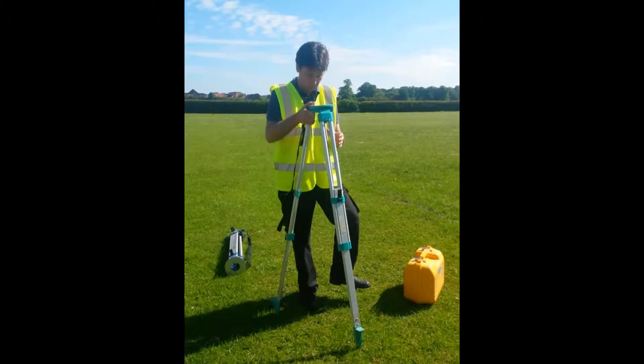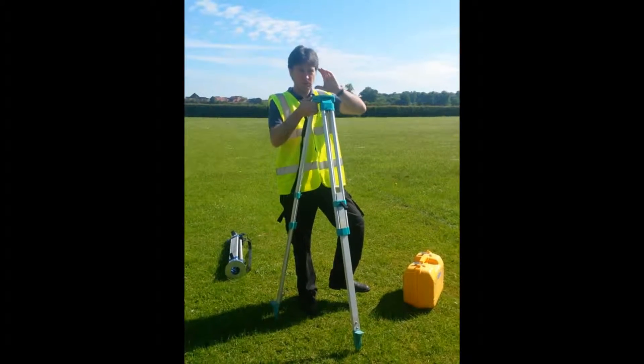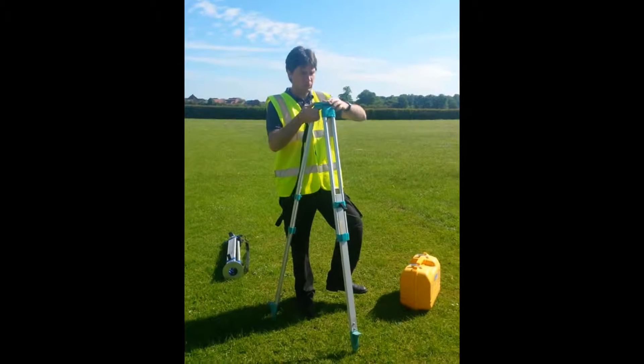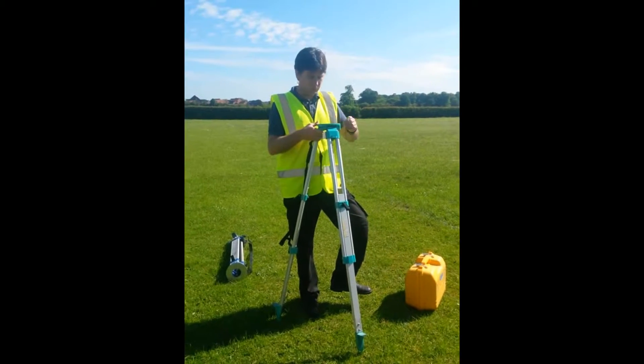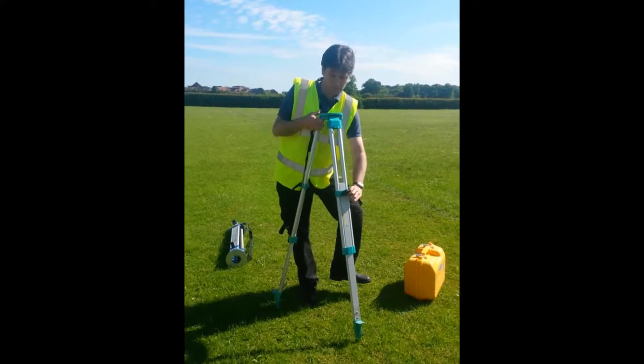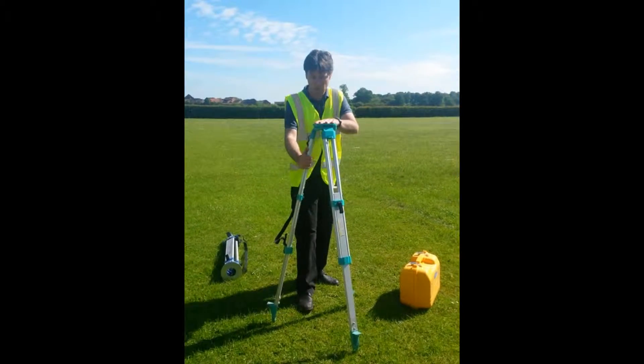I'll uncramp all three, pull them up, and try to get that horizontal. With leveling it will be up here because the level instrument is short. The theodolites are actually quite deep instruments — you only need it up to about the bottom of your rib cage. Work out the shortest in your group and set it so everyone can use it.